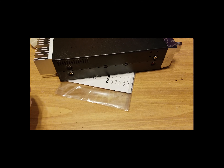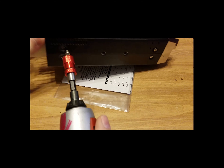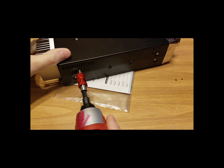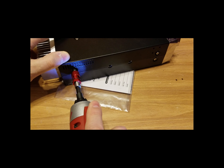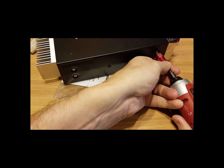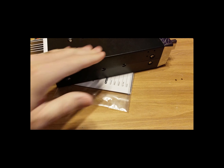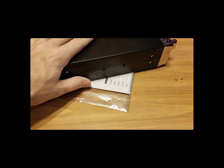Don't touch or twist anything. Don't try to adjust the modulation trimmer — without the proper trimmer tool you won't know where you're at. You don't adjust modulation by the meter swing; that's just not the way it's done. We're going to get the cover back on this and get it up on the bench.